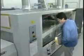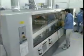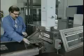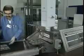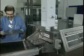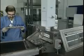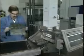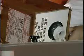Staying alert assures that the soldering process remains on track and that problems are remedied quickly if something starts to change. After the assemblies leave the wave soldering machine, they are usually loaded in a cleaning system to remove any flux residues. Cleaning should be done as soon as possible after soldering, at least within 30 minutes. If low residue, no clean fluxes have been used, this step is generally omitted.